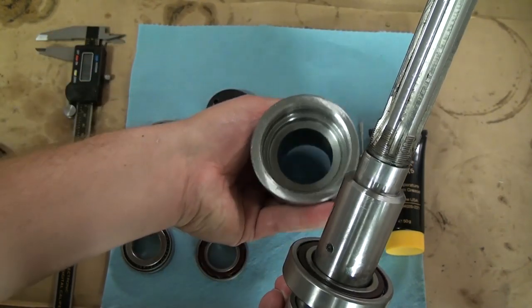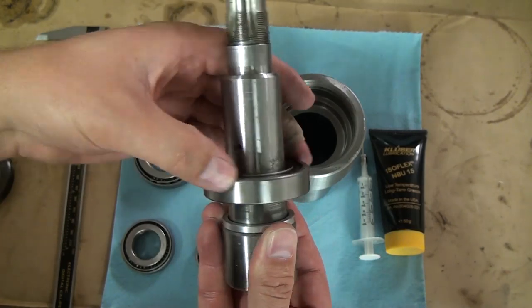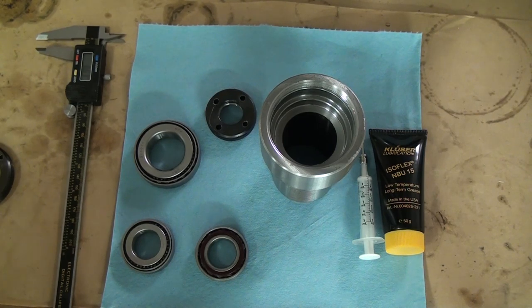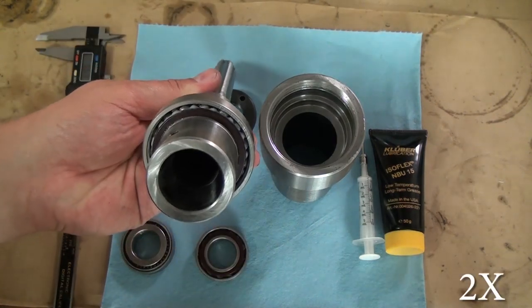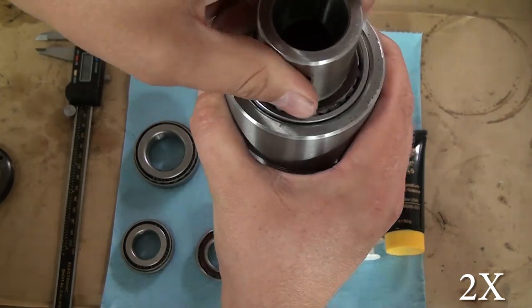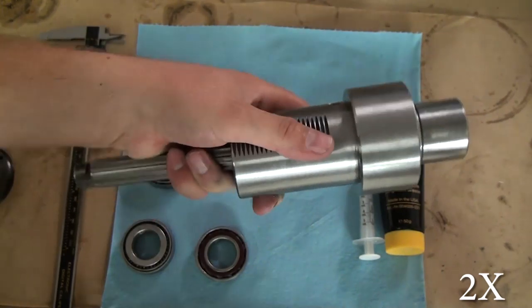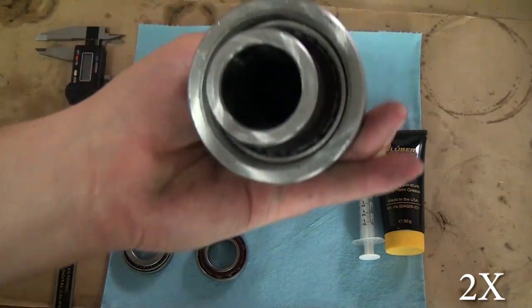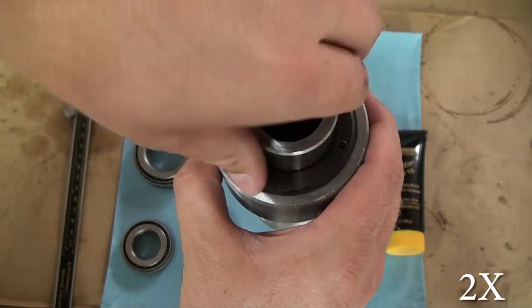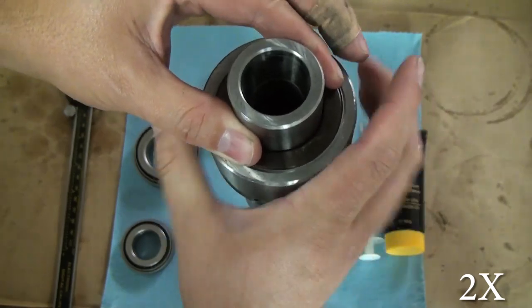See that hole in the spindle right above the bearing, on the side of the spindle shaft? That screw needs to come out so you can remove the bearing and install the new one, but you have to put that screw back in — because on mine, that screw is the thing that your R8 collet indexes against when you put an R8 arbor or collet up into the spindle. So you have to remember to reinstall that screw.